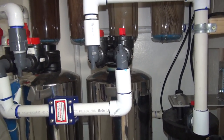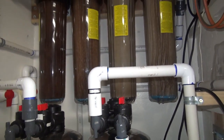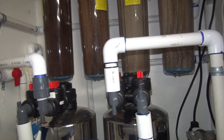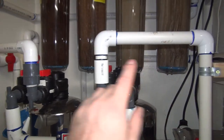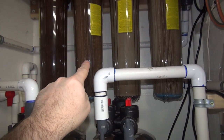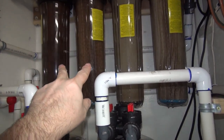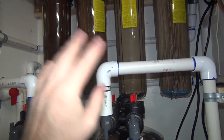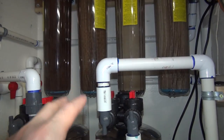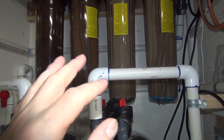We're not going to put a well in our backyard, but at least I can make sure it's clean water — or at the very least as sanitary as I can make it. My advice to everybody: if you can't do all of this — everybody's got their own budgets — if you can't even get into the charcoal, at least get two of these 20-inch filters. A couple hundred dollars, you can set this up. Get like a 5 or 20 micron and a 1 micron absolute on your water main — you at least get the junk out of the water. After that you can do something else at a countertop. This at least gets the junk out, your clothes will be cleaner, your shower won't clog up, your faucets won't clog up. It has helped the hard water situation by getting the clay and dirt and sand and crap out of the water.